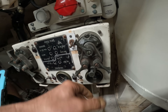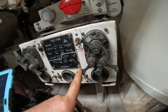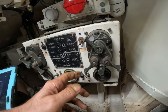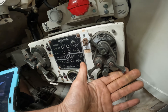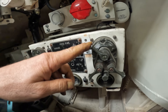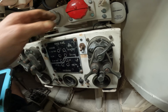This is the toggle that operates the electric starter motor. This other toggle operates the boost coil that helps give the ignition system a bit of extra zippity-zap. You pull both of them in together at the same time, and when you release the starter motor you're releasing the boost coil. With the magnetos it's a four-position switch: off, left, right and both.